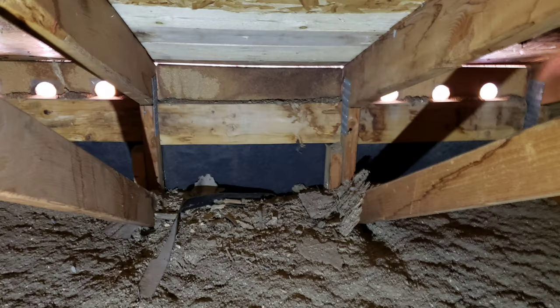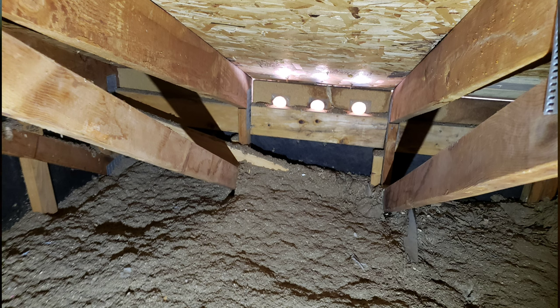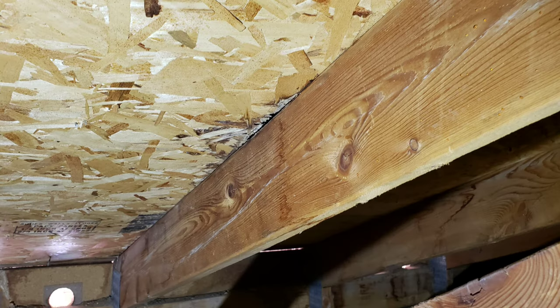Let's get a closer look. This is water-damaged sheathing, water-damaged soffit vent. All of this has absorbed water - all that wood is in need of replacement because it's bowing. If it was just water-stained that would be one thing, but the garage smells like mold.